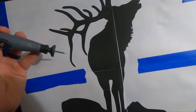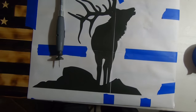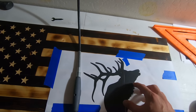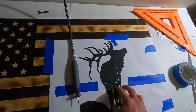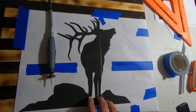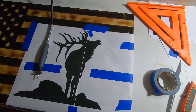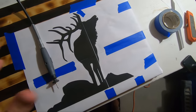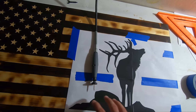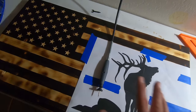The way I'm going to do it is just slightly buzz through the paper, and then it will start buzzing on the wood. First I'll do a light outline, tracing all the lines around the whole edge. You should actually start in the middle first — if you do the whole edge first and there's more detail in the middle, the middle is just going to fall out. So start in the middle and work your way out so that no paper ends up loose before you've engraved everything. I use the Dremel on full speed.